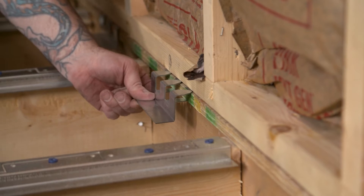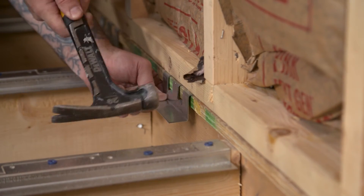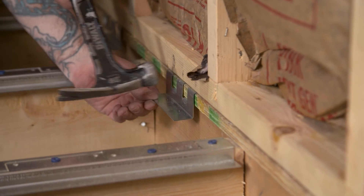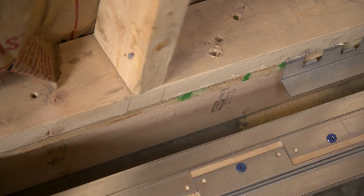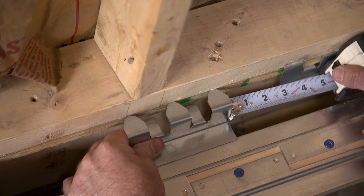The smaller C brackets will be installed where there is no exposed joist at the wall to base connection. When installing around the perimeter, do not leave more than a three-inch gap between the brackets, and support all corners with a suitable bracket and screws.